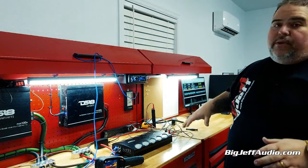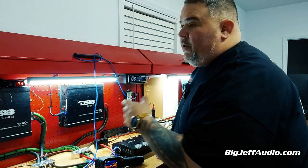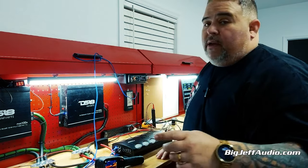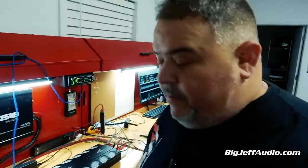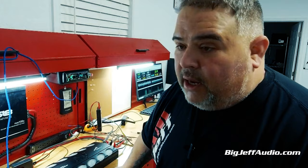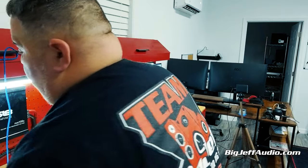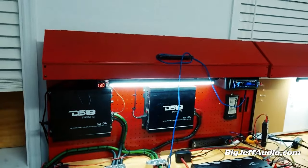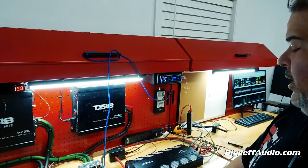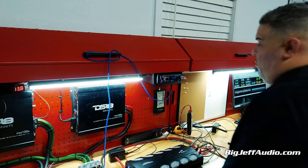Like anything else with videos, this is totally new — got to find my way, get my groove. We have a Dayton Audio to get the spectrum subs. We built something for the flex test, actually — something to put the subs in. So we're going to little by little step it up for you all. Once we get cranking, we're going to get a lot of products done. We got some voltage kicking — want to make sure we don't have a cell issue. I shut the power supplies off. Still reading 13.8, so the battery is going. We're going to do one last run at one ohm, 40 hertz, and we're going to see what we get with the power up.